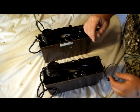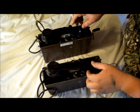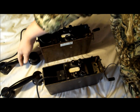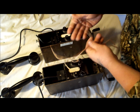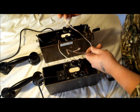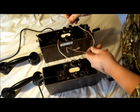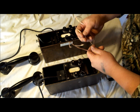Let's wire up a couple of these bad boys. How we're going to wire them is just a basic hardwire connection. This is what you're going to use if you want to run a couple of phones between some tents, campers, or between a couple of houses. Remove your handsets for both of them. This connection can be accomplished with just a basic speaker wire or household wire — any type of wire you can find will work. However, higher quality wire and better sheathing will give you better sound quality.